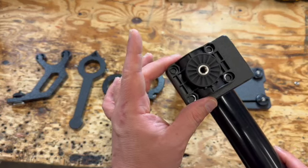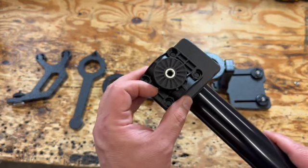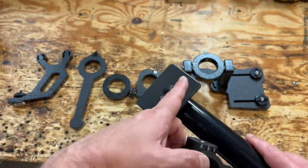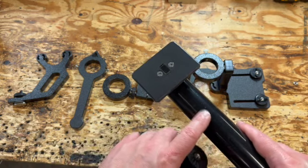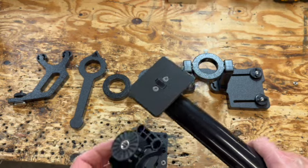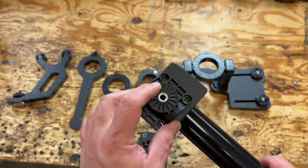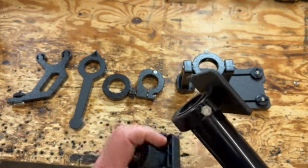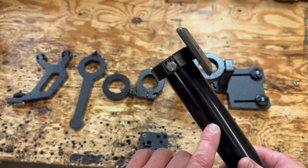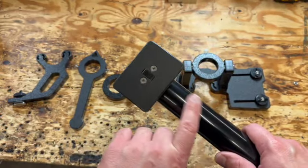I positioned mine to the lower side and to the far corner of the plate. The reason for that is when you put the transducer on and the electrical cord comes up, I just want to have it where the cord isn't sticking all the way out. We have another trick to show you how to run the cord up through the pipe — that's why we use such a large pipe, to accommodate the electrical head. So this will mount like that, and before you put the bolt through the shaft, you're going to want to run your head up there, or if you plan on drilling a hole from the side, then you can do that and it won't matter. In my case, I'm going to put a hole in the side to run the electrical head up through.